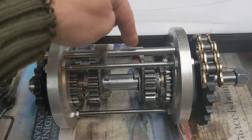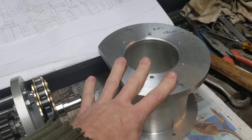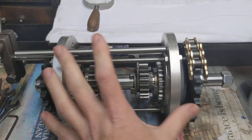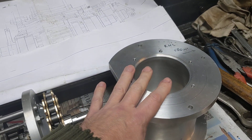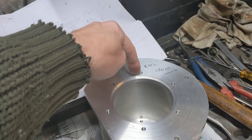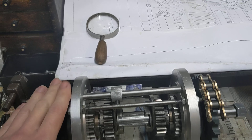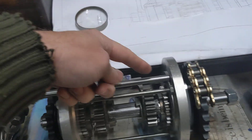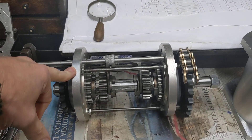That needs to be done from the top once we've put this into the gear case, and that is going to be a challenge because while it's easy to do this when you can see everything, once we put it in there we won't be able to see what we're doing — it's going to be a tight squeeze with fingers and hands. There are a couple of holes that need to be drilled for the gear selector shaft to come out of, and then we need to drill through here directly in line with this shaft to drill or mark the holes for the detent.